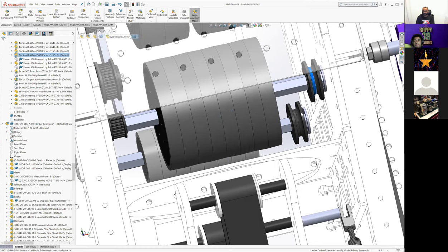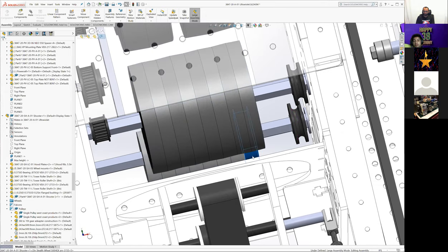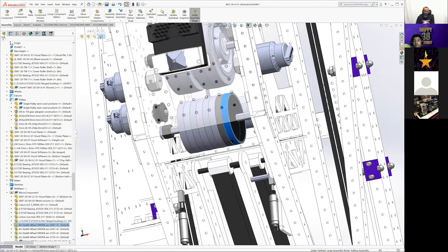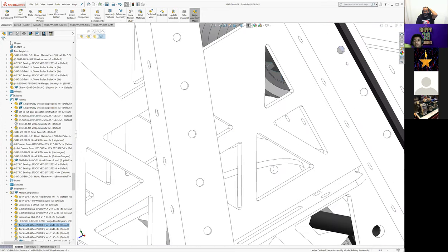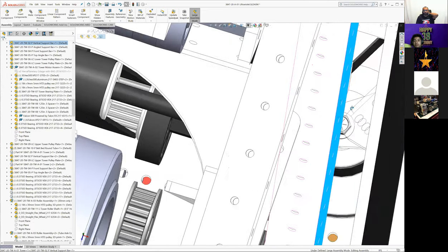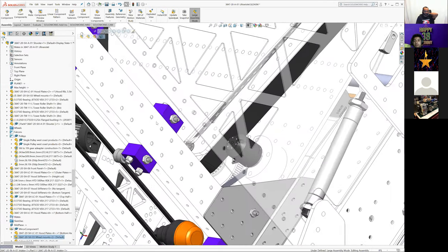These are the West Coast Products pulleys. I know we own some of the actual ones, but I think we might have run printed ones. They worked well enough. That let us have this back wheel rotating counter to the front accelerator wheel. That was a little bit tricky as we ended up having to mount it. We didn't have a lot of choices on spacing, as we were mounting it dead center through this tube to be able to get the bearing in place in this rail and get a bolt going through it nicely.